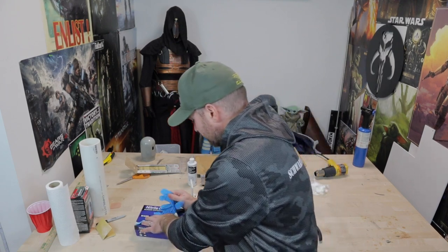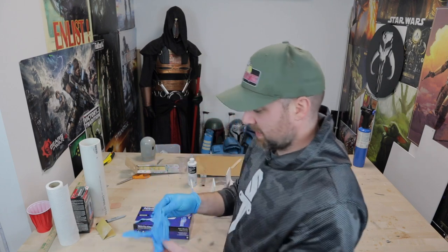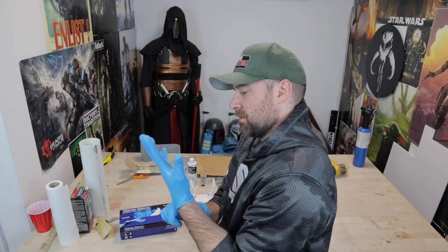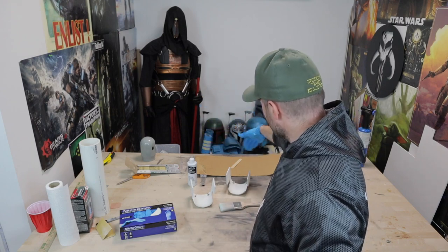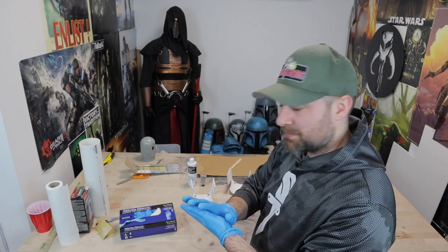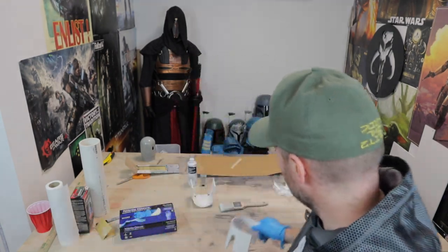When you're doing this, you want to tamp — not brush — tamp it down to get all the air out. Try to go as clean as possible. I recommend putting on two pairs of gloves: if you need to touch something you can strip off the nasty glove and still have a clean glove on your hand. I'm going to try to do three layers on each one, and hopefully after that you'll see that the fiberglass stiffens it up a little and adds the strength to keep it from cracking.